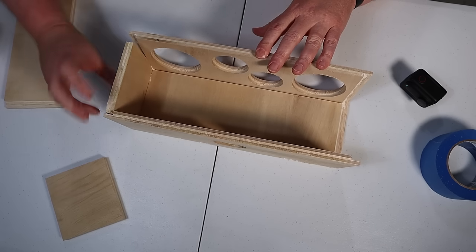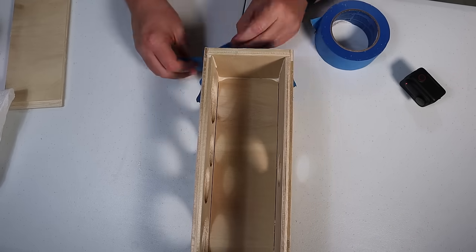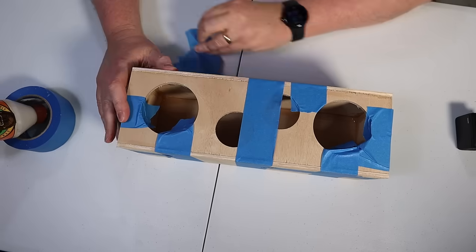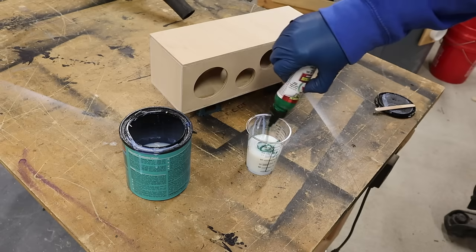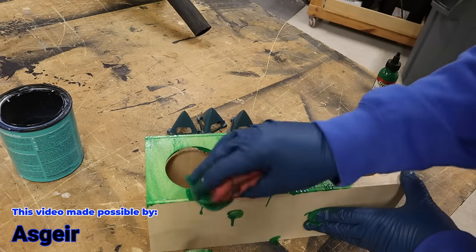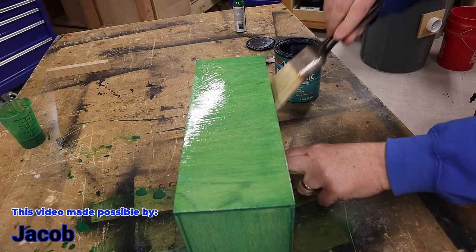You may notice that I'm not working out in the garage. It's wintertime and it's too cold for the glue to cure, so you're going to need to move inside. For a small project like this, you can just tape everything up and set it aside and wait a day for the glue to cure. For the finish, I'm shooting for something really bright, really vibrant, and really annoying. To do that, I'm going to mix some green unicorn spit in with some water-based poly. After it dries it'll have a chalky finish, so just hit it with a coat of the same water-based poly and it'll start to shine. This will turn out a lot better if you use a high quality plywood like Baltic Birch — this is some cheap sandy ply I got from Home Depot that I used because I just happened to have it on hand.